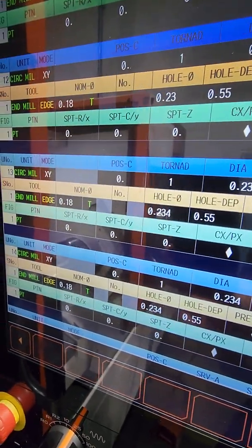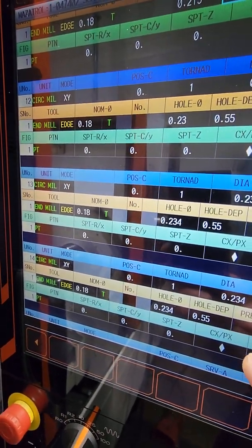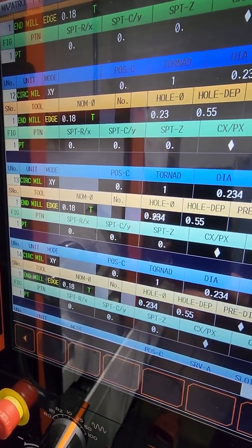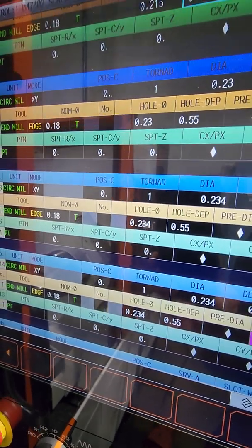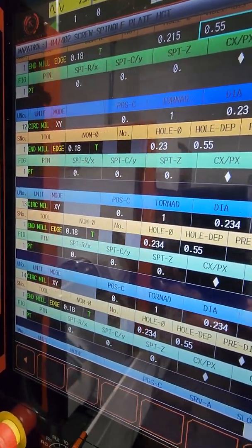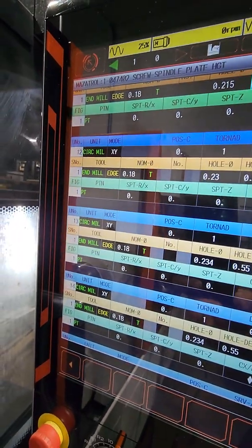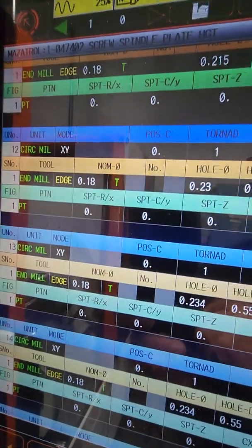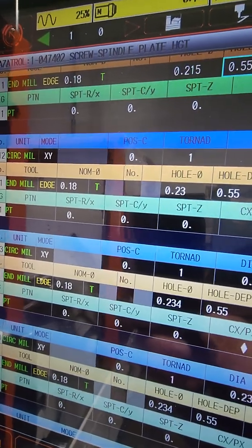It was a lot of pieces, so that free spin, or free cycle, pretty much removed the material from the deflecting tool because it's a pretty small tool. So that's the whole trick. You just gotta remember, once you have the tool, the trick is to set it up in the machine as an end mill.